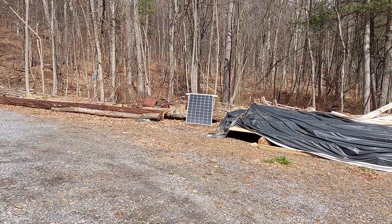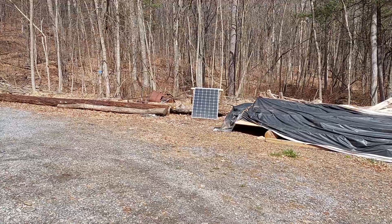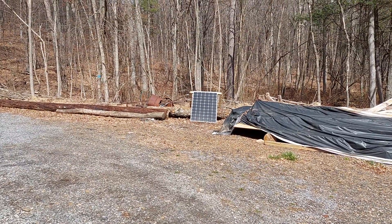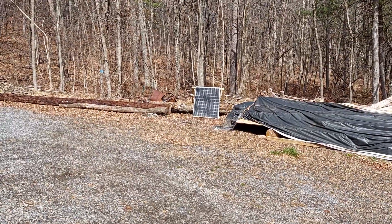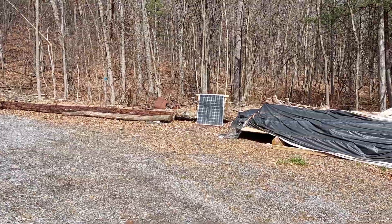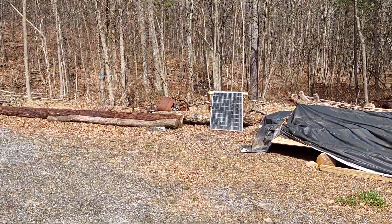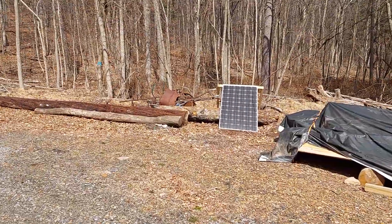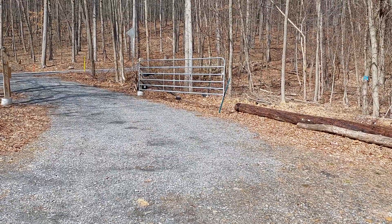I live — this thing resides in northeastern PA where I don't get a ton of sun in the winter, so I just decided to put a big solar panel that I had just laying around, with a little charge controller. It's actually connected directly to the battery — it doesn't run through the Mighty Mule circuitry at all. So all it does, a little charge controller on the back, keeps the battery charged.